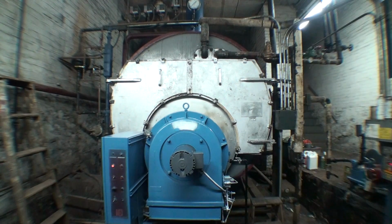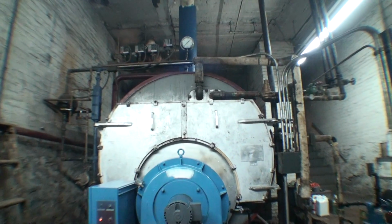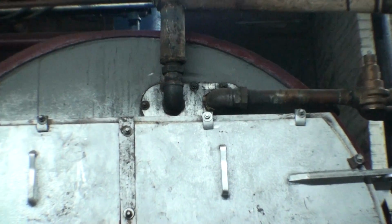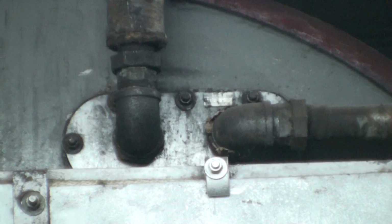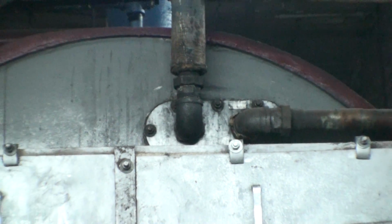But also, just getting a quick description of this boiler. This system is a one-pipe steam heating system. If you take a look, this boiler does heat and also domestic hot water. This contraption that I'm zooming in on right now is the tankless coil for the domestic hot water. This is how the building gets its hot water as well.